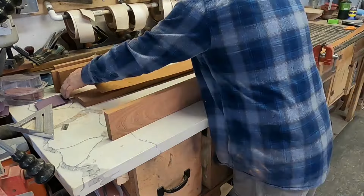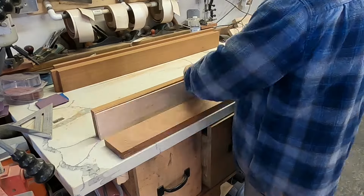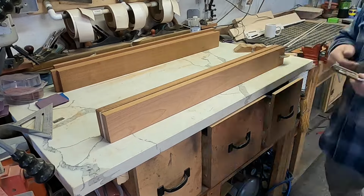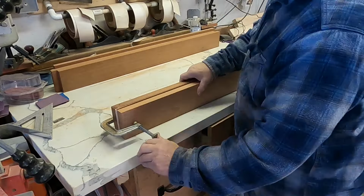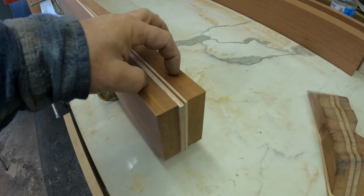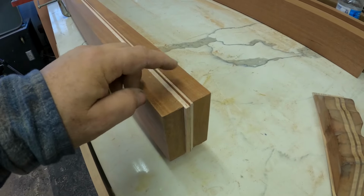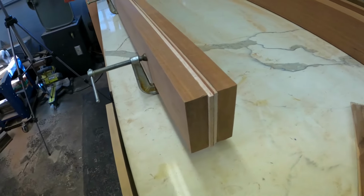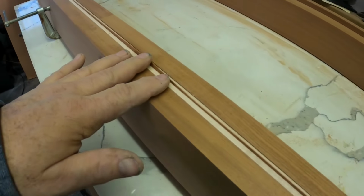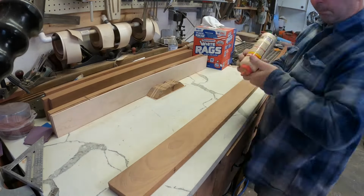I actually planned ahead well enough when cutting the maple to end up with small cutoffs for fretboard binding. Not sure why my brain was 11% more efficient than normal today. Okay, that's going to be one of the neck blanks. So two mahoganies, two maples. These are super flamey. And then a piece of mahogany veneer in the middle of it. So pretty understated, pretty simple, but I think that maple stripe is going to look amazing. So now I think it's just glue up this neck blank.